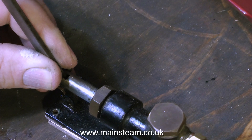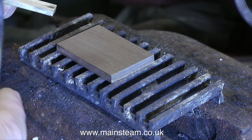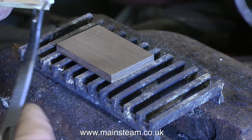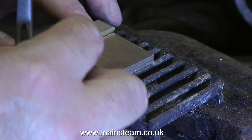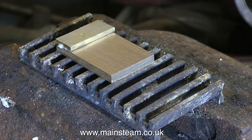So the first thing to do is to silver solder the fitting — soft soldering wouldn't be strong enough. For small jobs I normally silver solder on a piece of locomotive fire grate on the top of my vice. What I'm doing at the moment is spreading some flux — this is Easy-Flo Number Two flux — onto a piece of brass, which I then press into position on the second piece of brass. After which the entire assembly needs to be heated up with the blow lamp. I'm using my battery-powered igniter for the initial spark, just in case you're wondering what that clicking noise was.